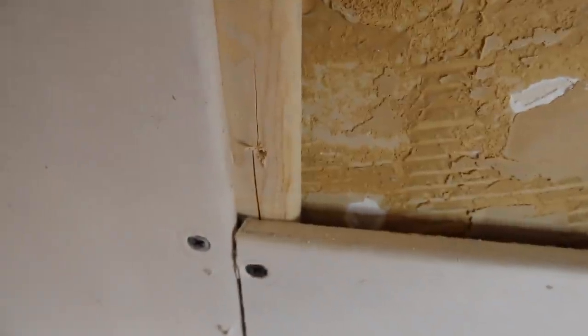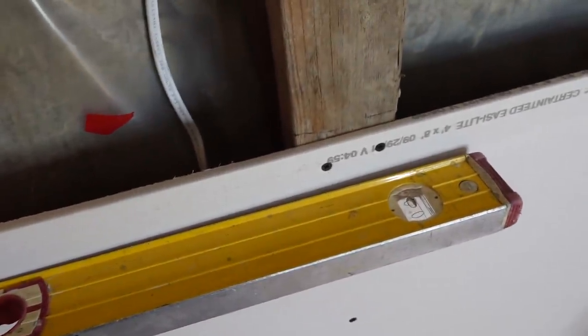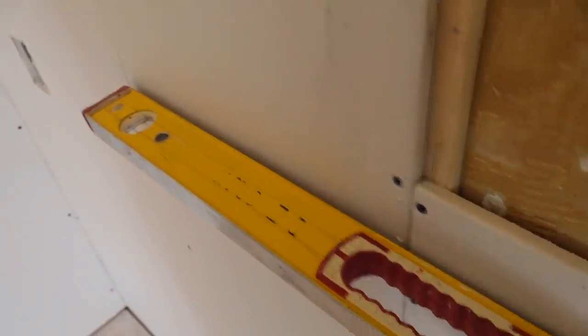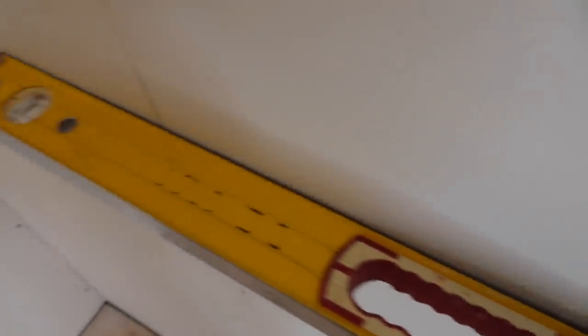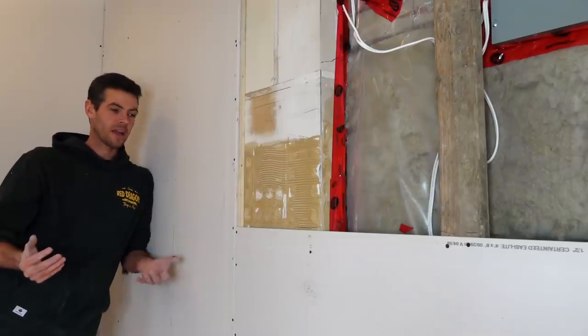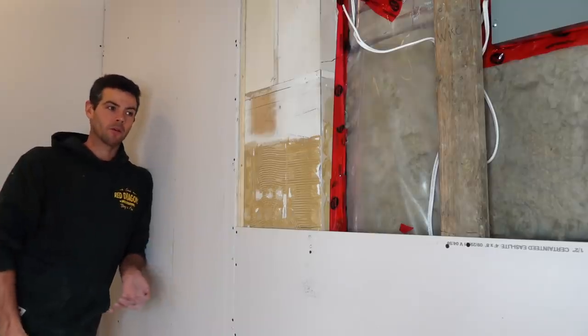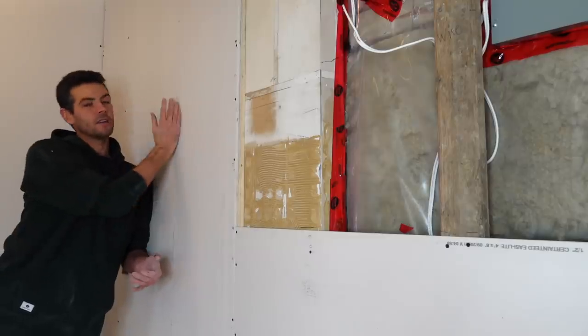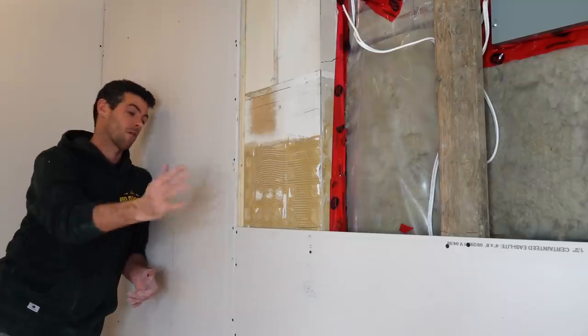Now let's take a look. It's tight there and that's looking fantastic. If we split the difference, we've got a quarter inch there and about a quarter inch there. But when we push it tight on this side, we can see there's about an eighth of an inch. So once we tape and float it out, it's going to be even flatter than it was — that's looking pretty good. With a little careful planning, you can actually make stuff work out better. We put the joint here because it'll help build it out even more. If I put the joint over there or over here, it would just make the wall wavier. Now we just have one big long wave instead of multiple waves or a massive wave that's going to require an inch of mud.